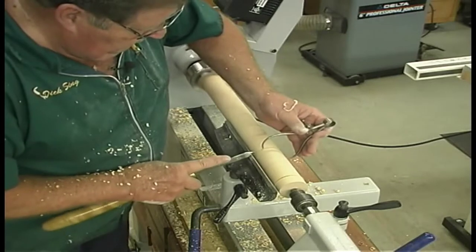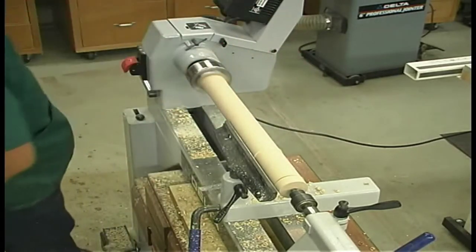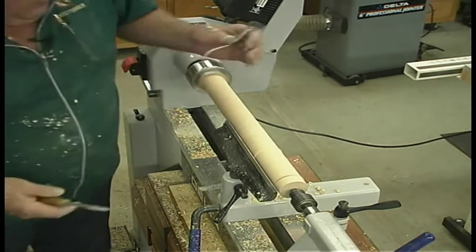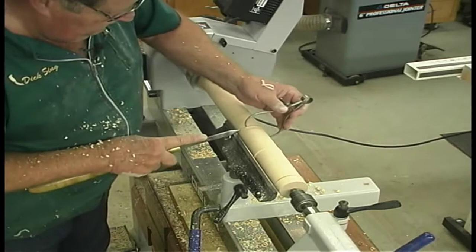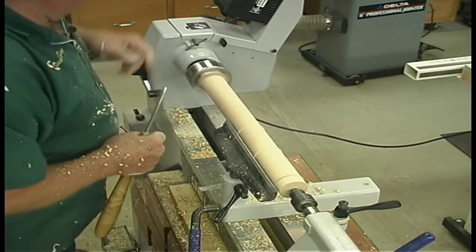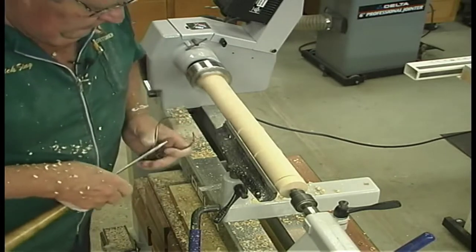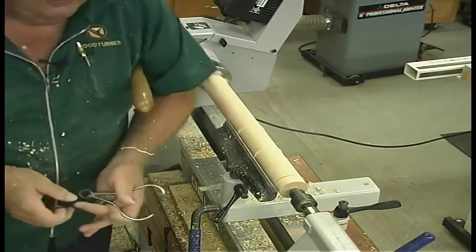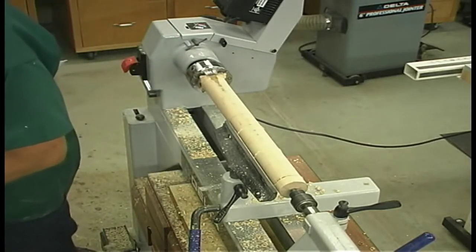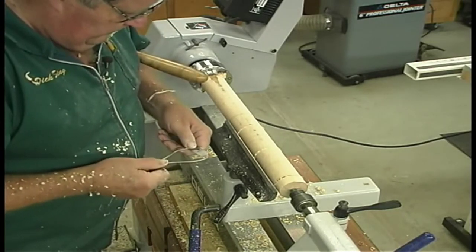This one's going to be a 2-inch cut. As is this one. Now, if you were doing a lot of this work, when you go to your flea markets, buy up a bunch of calipers and preset them, and you won't have to go back and forth setting them. Now, this particular one is 1 1/8 inches.